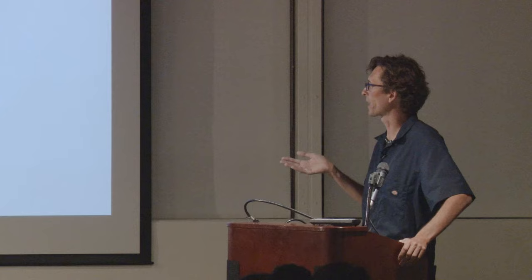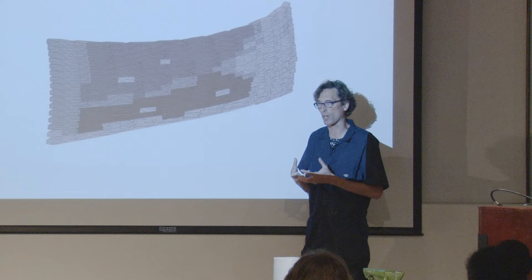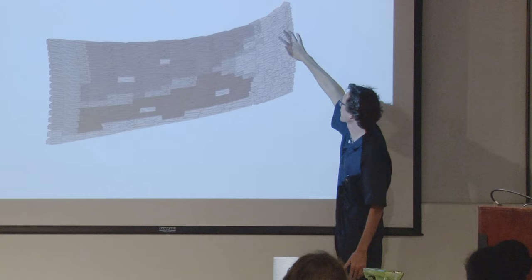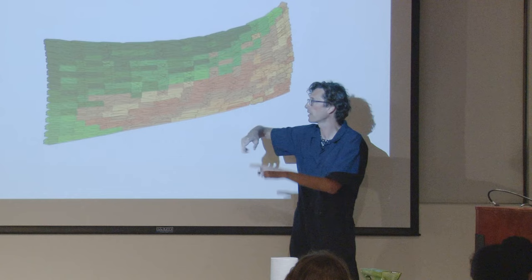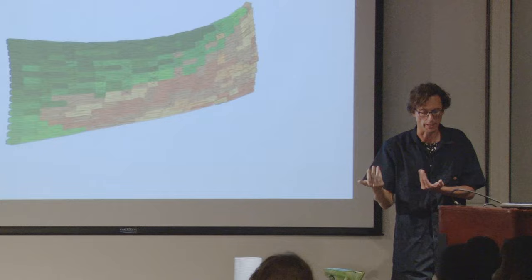Which then, when we also think about color and about reflectivity, whether it's matte or reflective, the areas that are for passive cooling have to be a porous clay body. You can't glaze it, because when you glaze it, that seals the water in. So this just indicates that these would be the areas that are the most porous and the most matte, the least reflective. There are other areas around here that could be as reflective as I want. They could be any color. This is a color diagram. Again, these areas would need to be exactly the same color as the clay body that I'm casting with. Whereas these areas up on top want to be as dark as possible, because they want to absorb as much sunlight as possible. So I would glaze those in a really dark color. I chose green, because I like green. But the only important thing is that they're dark, right? Dark and matte, so they absorb as much sunlight as possible.